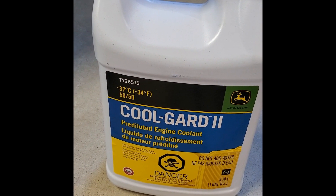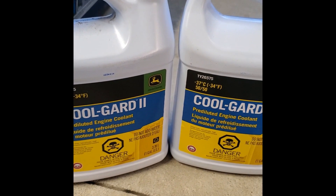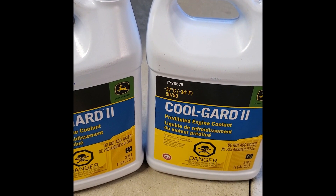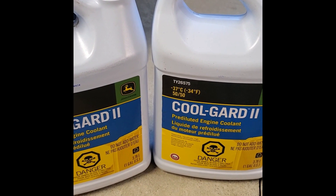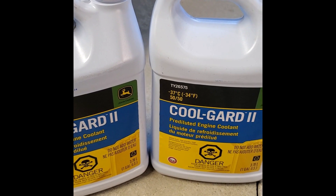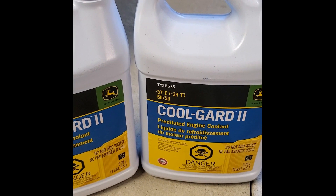When you're doing this on a 2520, grab a couple of gallons of CoolGuard 2. Just open up the radiator cap, pour it all in there until it's towards the top, and then fill up your expansion tank between the two lines — your full and low lines. The expansion tank does have a bleed-off on it, so I think it kind of self-burps itself and gets everything moving like it wants to move.